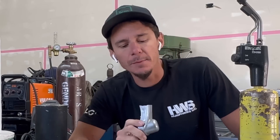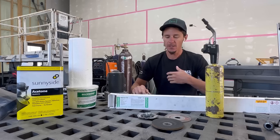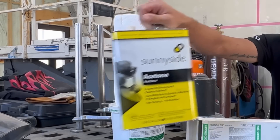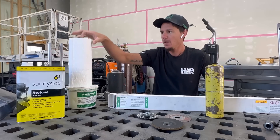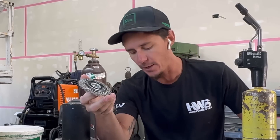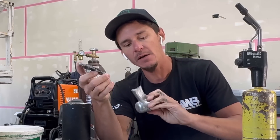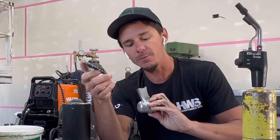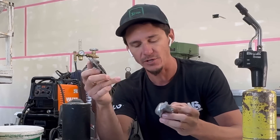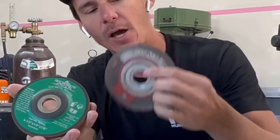When you're dealing with cast aluminum — really any cast aluminum — it's a very dirty metal, meaning you need a host of tools to clean it. I like to use acetone to start off, just to degrease it because it doesn't leave a residue. Paper towels to wipe the acetone on and off. Then I'll move over to a stainless wire wheel and hit the inside of the area, get any oxidization that's built up, or any grease that got stuck in there that the acetone couldn't get because this is a porous area. Then you're going to need your specialty aluminum grinding discs and cutoff wheels — these are specifically made for aluminum, less chance of contaminants.